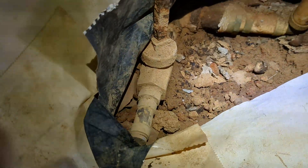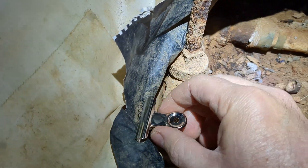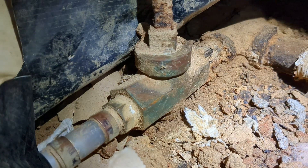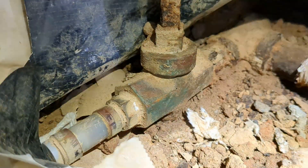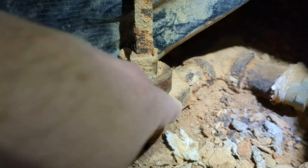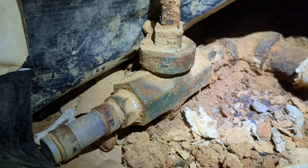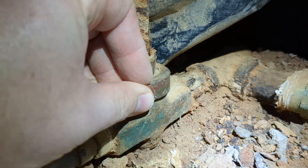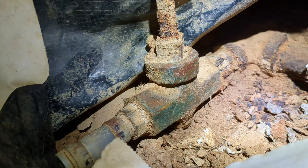I want to get out of here, but I'll probably check this pipe as well. So it's not magnetic. I'm going to wipe it off a little bit. I cleaned it off a bit more with the rag and the penny. And as you can see, I think that's copper — I think all of this is copper. It's green. That over there is some sort of PEX or PVC. And yeah, the green's kind of scraping off there. I think I'm good — I don't think any of this is lead.